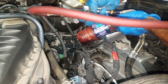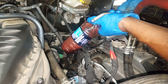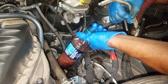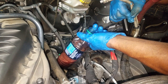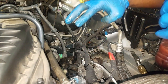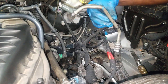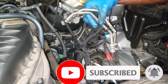See that? It's blowing out — that means the cooler is not restricted. I can't overstate this: I am not cleaning the cooler, I'm simply verifying that it's not restricted. And it is not — so it's safe to put this on. That's a quick tip, a not-so-professional way to check your cooler after replacing a transmission. The last thing you want is a restricted cooler on a brand new or reconditioned transmission — it will come back burned up. This cooler is not restricted, there was no machine available, and this car really had to go. Do what you've got to do. Thanks for watching.